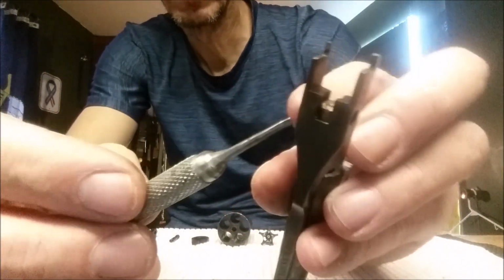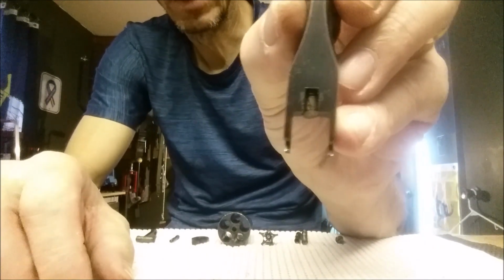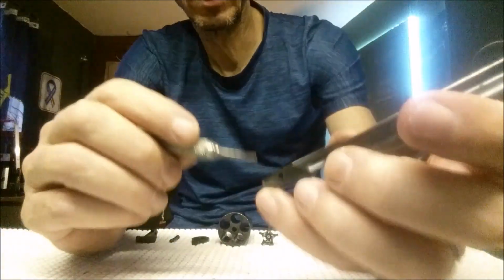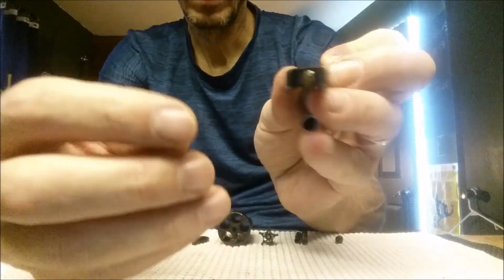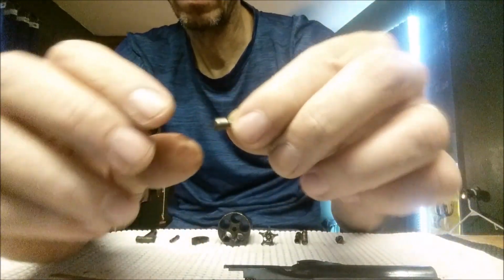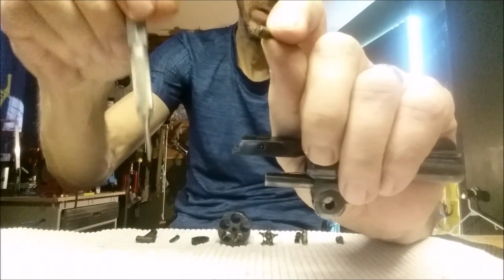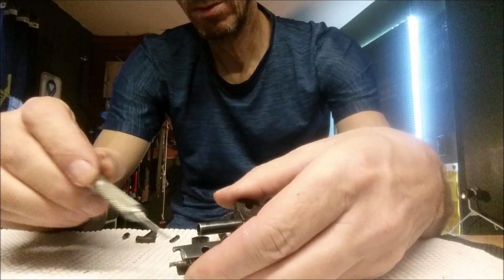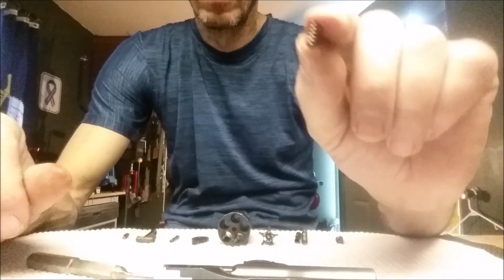And then back here, you'll see it's like the little plunger. You can tap it down. Sometimes you can just push on them and get them to flick themselves out, but if not, tap down on it and you can see it's created a little gap right there that I should be able to grab a hold of and pull the rest of the way out. And remember how that was in there, so it has a bevel on it. I'll show you as I pull this out. So there's a bevel like that, and the most pointed-in part faces downward in here. So pull that out, and then we'll pull the spring. It's a small spring, not very big. A very small spring right there.